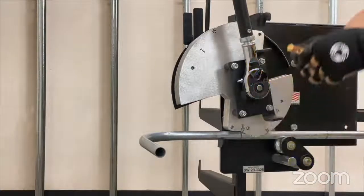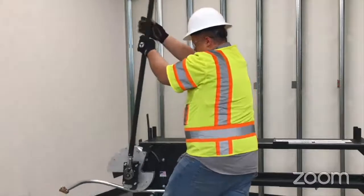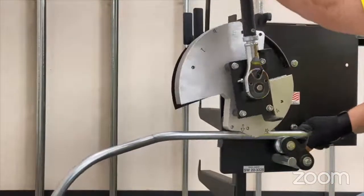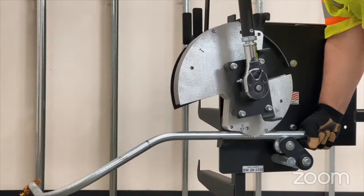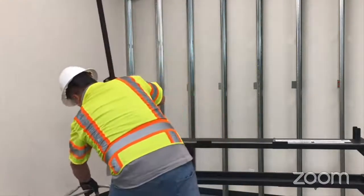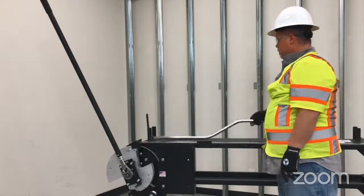We'll go ahead and put our conduit level on there to make sure our hook is parallel to the floor, then do our first bend. We'll spin it around, line up with the arrow. Some folks just have a really good eye for square and parallel. One nice thing is you can sight down that one-inch groove to see that you're not dogged. Also notice how close we are to the end of that conduit — this would be a real tough bend with a hand bender, but in this case, pretty easy. We put it on the table, confirm everything's square and parallel. I've got my 90 perpendicular in both directions and my offset's on the money.